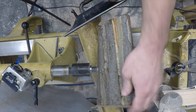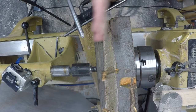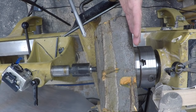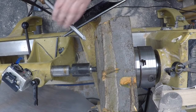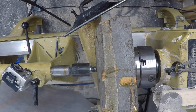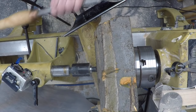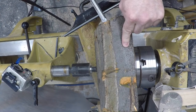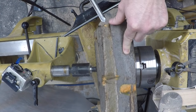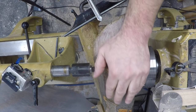The other thing I need to mention is that you always want to make this cut from right to left so that you're going with the grain. You may be coming straight across — that's okay. You may be coming at a 45 — that's okay. You may be over here cutting on face grain going from right to left — that's okay. But you don't want to be coming in the other direction, because then you're going directly into end grain, and that's going to make it a very brutal cut — it could even cause a leverage catch and really bad things to happen.